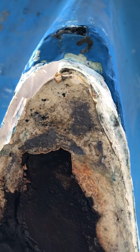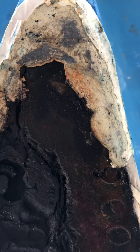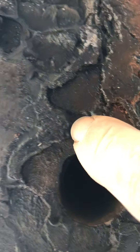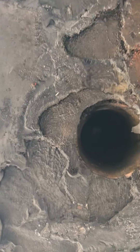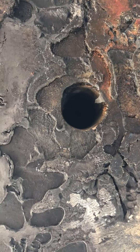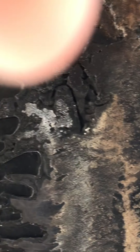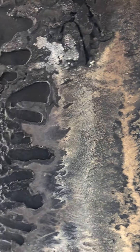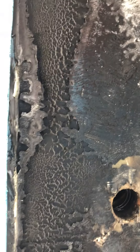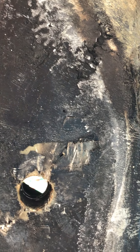This is the leading edge of the keel, and you can see where the passage was for the moisture coming up to bolt hole number one. You can see all sorts of voids in the Sikaflex where it was. Here you can see this was a total void — look at all these voids we've got in the Sikaflex, and there's no mating Sikaflex on the keel itself.